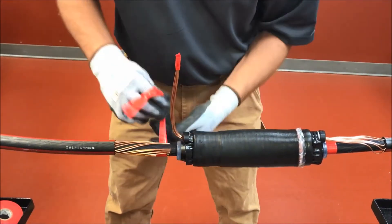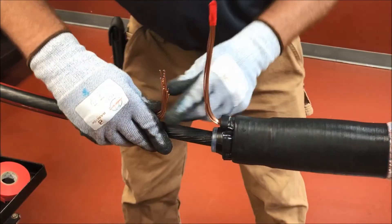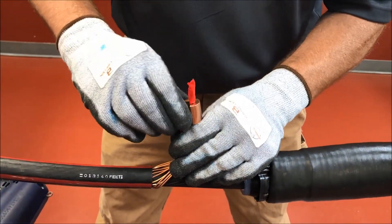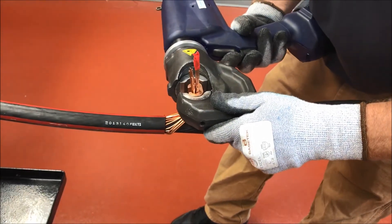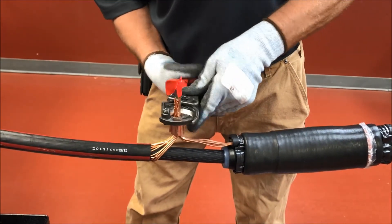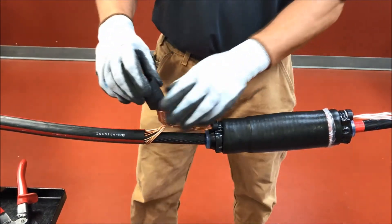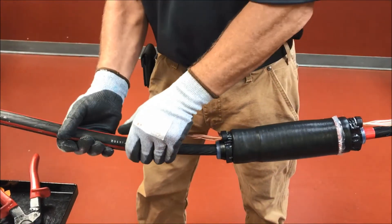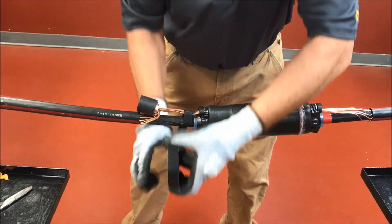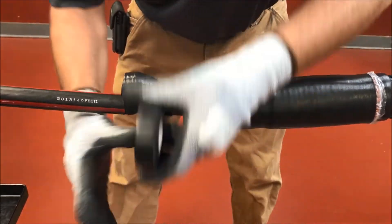Step 10: remove tape and lift up neutral wires. Remove the temporary tape that was applied in Step 2. Lift the neutral wires up vertically and bring them close to the neutral wires from the pass-through tube. Install a C-crimp connector on the neutral wires and crimp them together. Cut off any excess neutral wires at the connector. Bend the connector down to the side away from the splice. Wrap the C-crimp connector with vinyl tape as shown. Tape over neutrals and C-crimp from jacket to the end of the pass-through tube. Repeat for the other side.